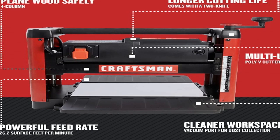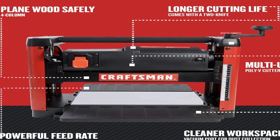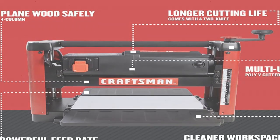This is a common occurrence with planers — we didn't deduct any points. Just be aware that it occurs and plan to plane boards a couple of inches longer than the desired finish length.